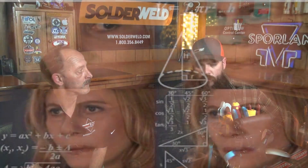At the end of the day, my biggest retraction and teachable moment for myself and everybody else is to make sure you check with specific manufacturers with variable speed equipment and find out if there's a factor, an equation, a conversion — something that will give you true frequency to compare against this feature if you're going to use it. Because clearly, the discrepancy was actually dead on after we peeled all the layers back and I had a chance to speak with all the manufacturers involved. I even called York's VRF department, and they don't even 100% seem to know what the conversion is — but they know it's not one-to-one.